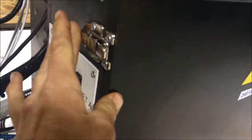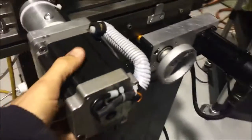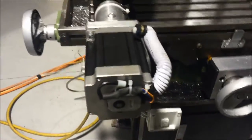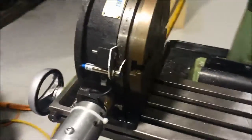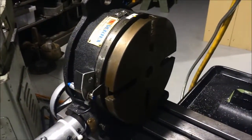What I'm here to show you is the closed loop stepper deal. I took a two phase stepper motor, just a regular NEMA 34, about four and a half to five Newton meters of torque. Nothing special. I've adapted it to the handle where the crank handle was, via a coupling to my rotary table.